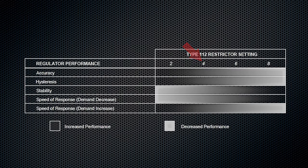However, the restrictor can be used to fine tune the regulator for maximum performance. Decrease the restrictor setting for tighter control, increased opening speed, and decreased closing speed. The 8th position has the largest flow, is the most stable, and is recommended for dirty service where the restrictor may be blocked by solid particulates. The 2nd position has the smallest flow passage.